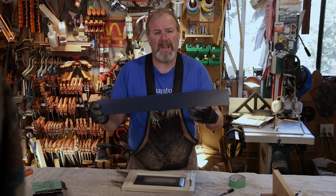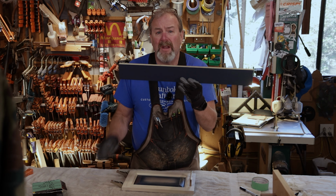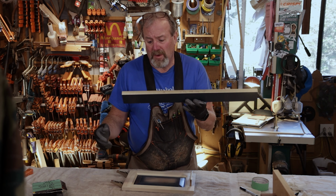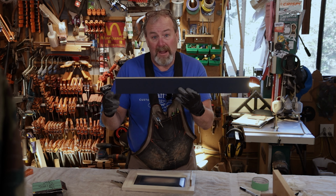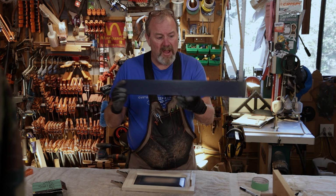All right, so the first tip is if you're ever going to make toe kicks, make them out of solid wood. Don't make them out of 1/4-inch plywood and cheap out, because that's just crap. These get a lot of abuse. You put 1/4-inch in there, and I've seen it before. I've actually had to pull some out and replace it with solid wood. It gets beat up. So solid wood toe kicks, and they'll help you out.